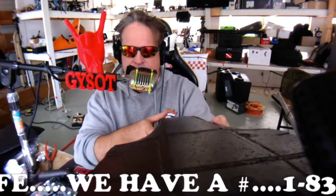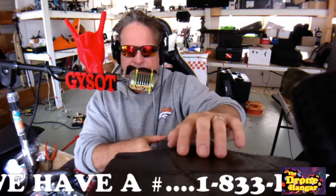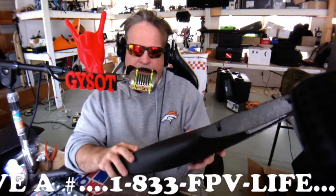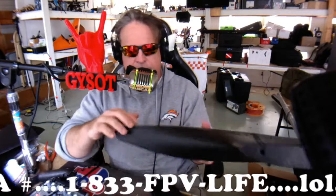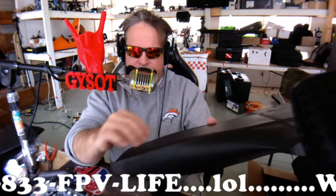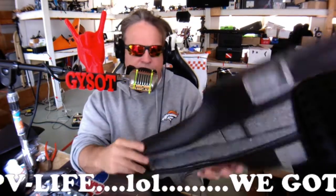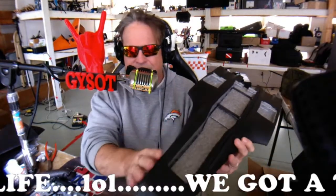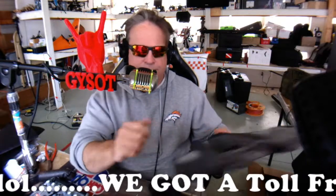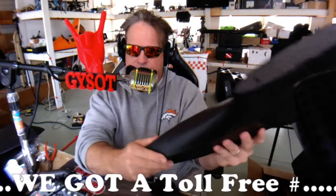It's nice and smooth. You don't see any gray. What you're looking for is to seal it all up. So you put one layer down, let it sit for a while and dry, and then go in there and check it out. Look at it again, and you'll see these divots and these little dimples. Some of the gray will still be showing, so go back and do another coat. That's why it takes 2. And I think I did a little extra on the sides right here. Then I spot painted a little bit, and it was fine. It looks great. It's all sealed up, super strong.